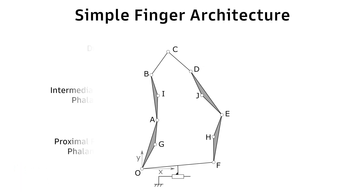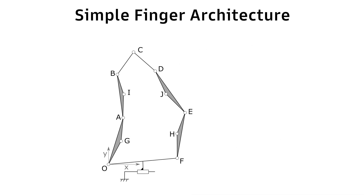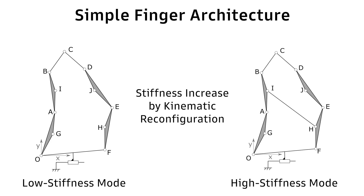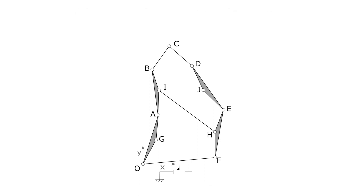The finger proposed has a very simple architecture composed of three rigid links at the front and back connected by flexures, represented by revolute links on these pictures. By adding an internal crossbeam, like the Festo fingers, a kinematic configuration is made to increase the stiffness of the finger.